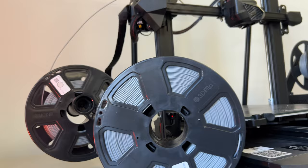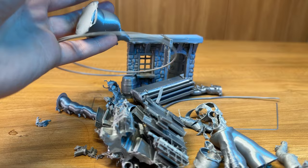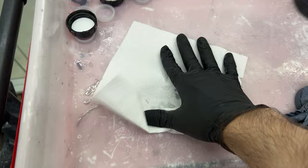Another big difference between the technologies is the process before and after printing. In FDM printers, we deal with thermoplastic that, after being melted by the machine, becomes solid plastic again. The output is simply solid plastic pieces, which can still be recycled — and it makes a little mess, but it's easy to clean. With resin printers, we need to be more careful. As it is a chemical compound, everything that contacts the resin must not touch the skin. In addition to using gloves, containers, tools, and cleaning papers must all be handled separately and waste disposed of correctly.